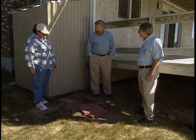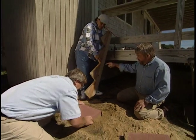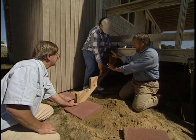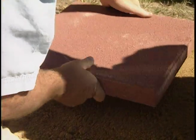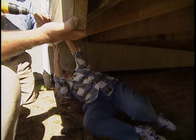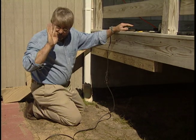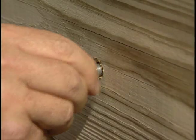Let's grab some materials and get to work. Now, this is what's going to actually support the stairs — it's the bones of the stairs, if you would. Len bought pre-cut stringers for this job, and while the pre-cuts make the job easier, they do require that the landing at the bottom of the stairs be at just the right height. In this case, we have to raise the landing, which is made of concrete pavers, by adding sand underneath. We need to make an extension to your rim joist there, kind of a ledger, and then attach this assembly to the rim joist with rust-resistant screws. I've marked the location of the stringers — we're going to use four of them in this stairway — because I'm going to be attaching this to the rim joist with carriage bolts, and I don't want those carriage bolts to be in the way of the stringers.